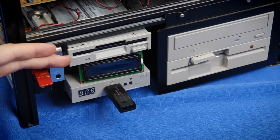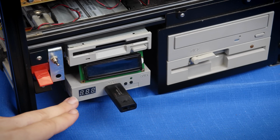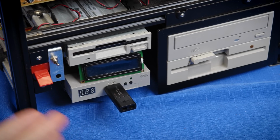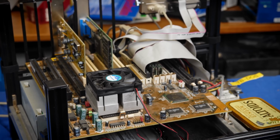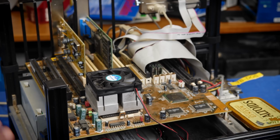So the floppy switchboard allows me to have both the 3.5, 5.25, and emulator drive in here without needing to change any cables or anything. And this is also important because I could, of course, have a 4-floppy controller in here to do that, but the motherboard up in this computer is not necessarily always going to be the same. So having a custom interface to the floppies instead of a custom floppy controller makes this thing a little bit more compatible as a chassis instead of as a system.